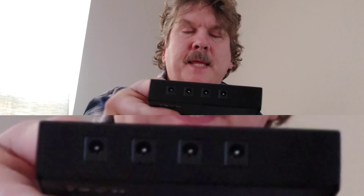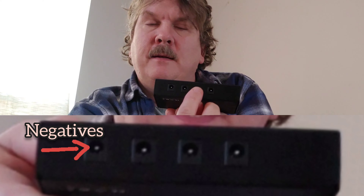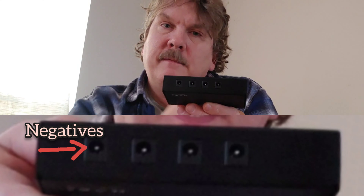When I tested it with my multimeter, I can tell the grounds are truly separated electrically. There are eight power connections, and the center pole is the negative or the ground. I have the multimeter set to continuity — if things are electrically connected it'll beep. No beep means they're not connected. When I touch the two negative poles, we get nothing, because they're not connected. That's what you want in a power supply.